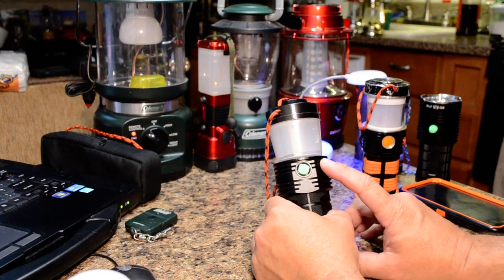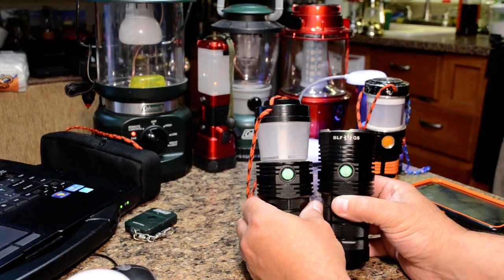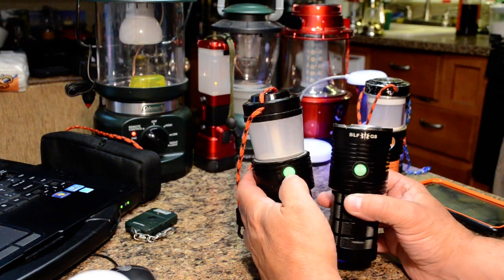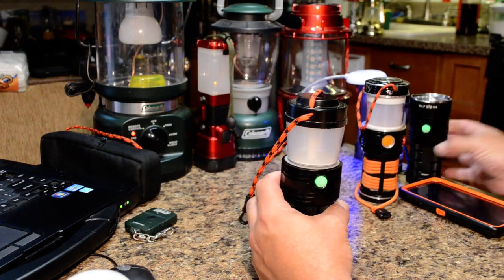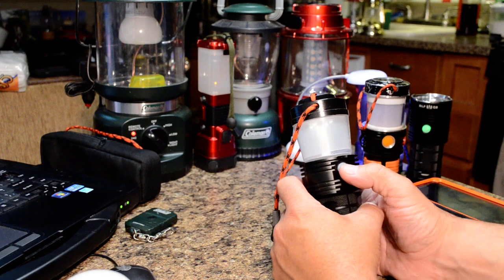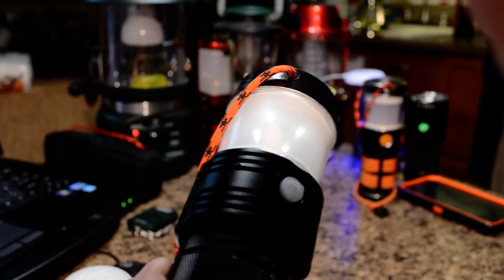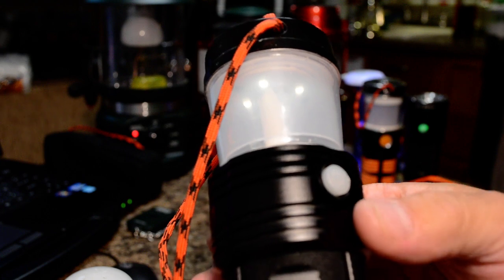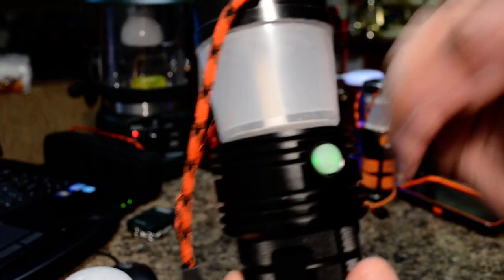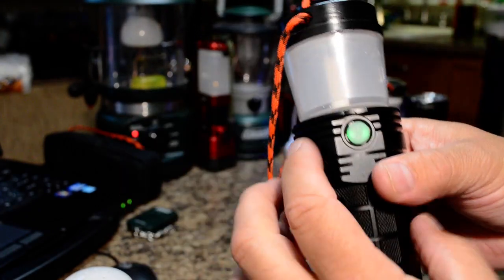Back to the midsection — from the last video we stopped at the charger point, so now we're talking about the actual switch. The original BLF Q8 has a green switch; this one still does. One suggestion is to change it to amber or yellow LEDs instead of green, because when it's completely dark it acts as a nightlight — like a firefly low mode. You can still see the four LEDs on the switch on low mode, and amber has a better effect for sleep.